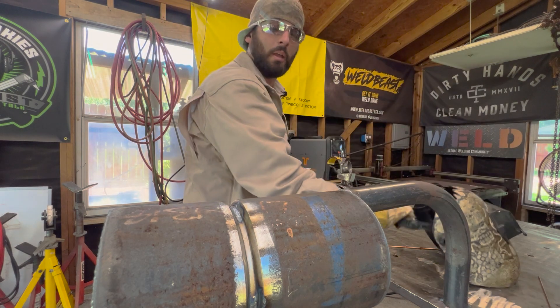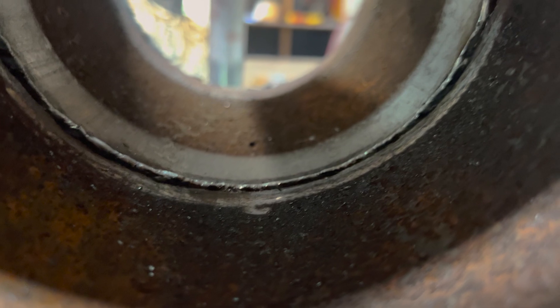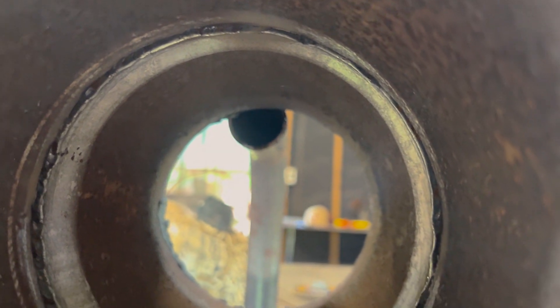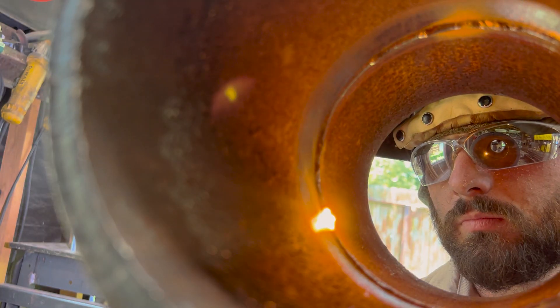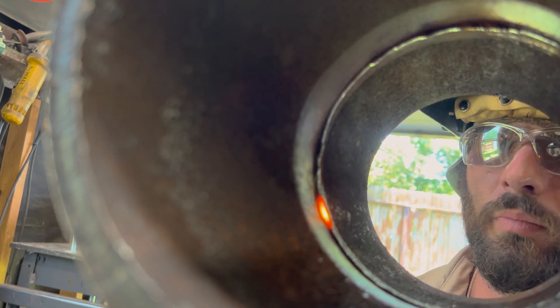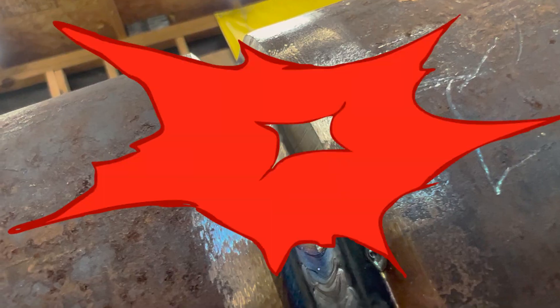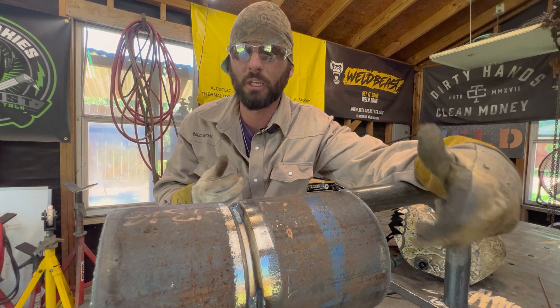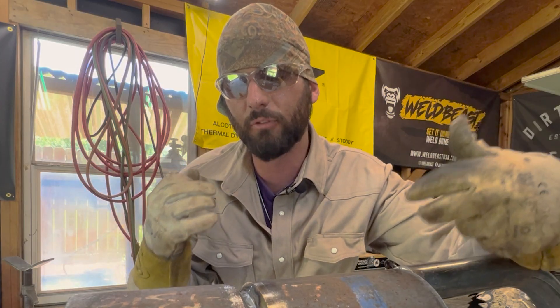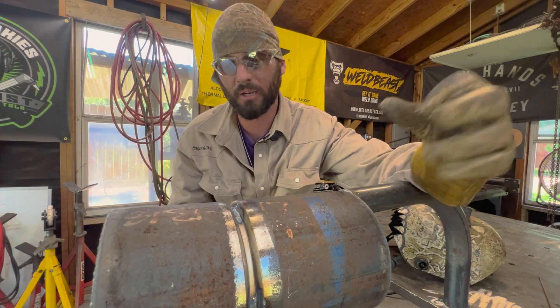We got our bead in there, and as you can see by the coloration, that's from not having to start and stop or slow down in any particular area. We had a nice gap where that wire didn't come through the top, and we were able to lay wire at the top and back-feed the bottom. I did end up having to stop — it seemed too cold — so I turned it up. I also found some cold wire, but a little tricky TIG work fixed that. For a smooth, clean, consistent root: no starts and stops, don't put heavy tacks in, clean them up or cut them out. Feed a little more at the bottom, less on the sides, and less on top. At the top let it sink, on the sides get up and around, and at the bottom feed into it to get that consistent root all the way through.